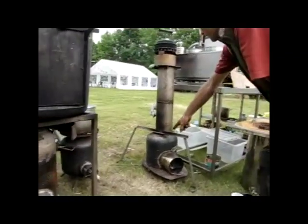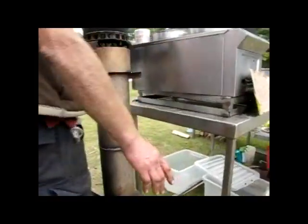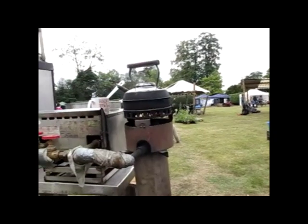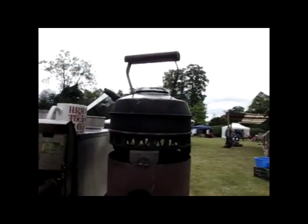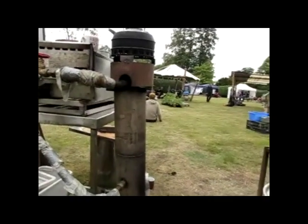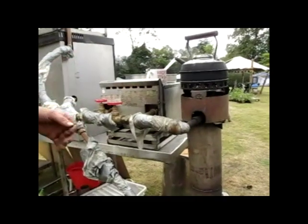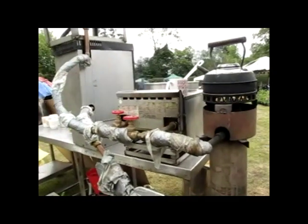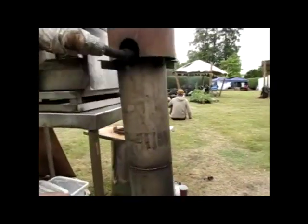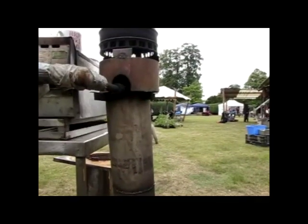Here's a miniature version going through a heat exchanger. Have a look around the back. If you're going to have efficient combustion and you're going to be capturing all the heat, maybe you don't want the heat to go into the sky. So I've bought myself a bain-marie — I love ripping the electrics out of these things. Taking all the electrics out, put a horseshoe of copper pipe in. Just convection of the heat, the hot water in this cylinder. And firing again, it's producing biochar and it's a very efficient burn.